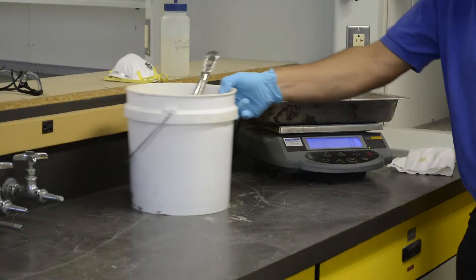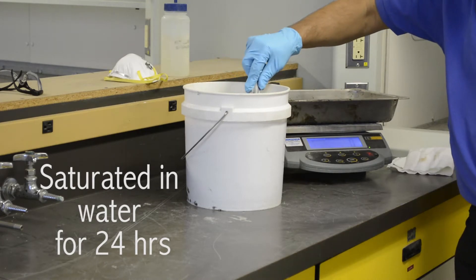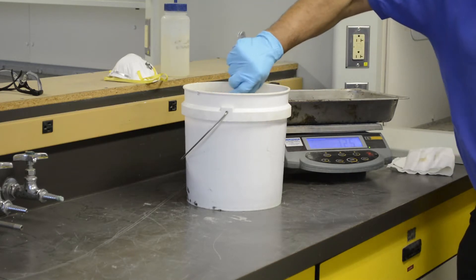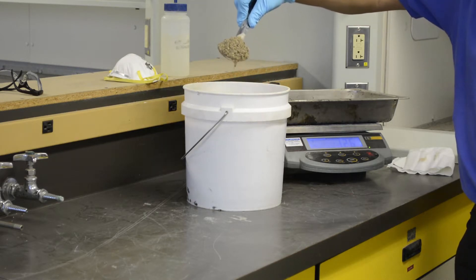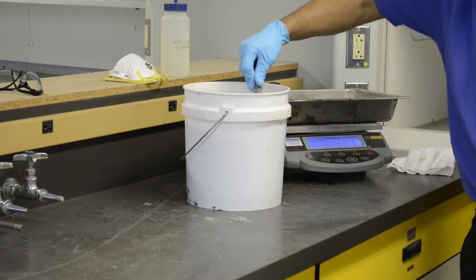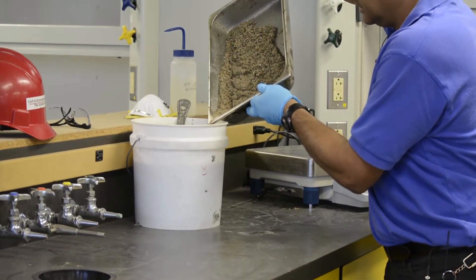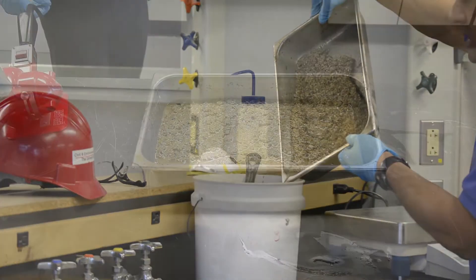The aggregate material has been prepared and has been soaking at least 24 hours. Obtain approximately 1000 grams of the fine aggregate from the sample and put it in the pan. While some of your team is preparing the aggregate sample to dry, another person can carefully clean the pan and dry it, making sure the pan is free from any aggregate. Remove excess water with care to avoid loss of fines.